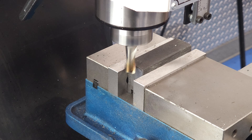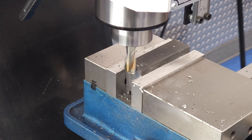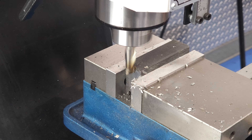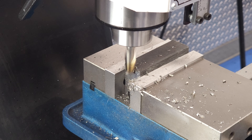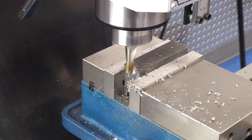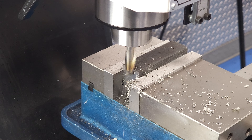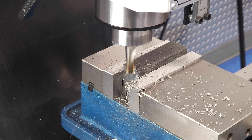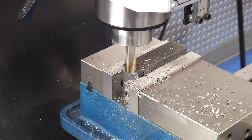How about milling slots? We have a half-inch two-flute end mill that we're going to play around with and see how much noise we can make. We'll do our cuts in reverse order from before and start with the big cut at a quarter inch depth of cut — 250 thou. At this depth it makes a lot of noise and a lot of vibration, but it hogs the material out when I ask it to. Yes, this is too big a cut and surface finish suffers, but it does the job without stalling.